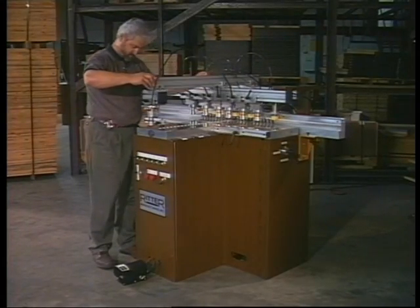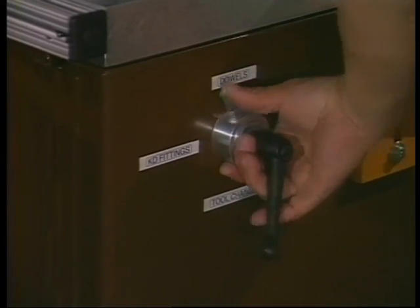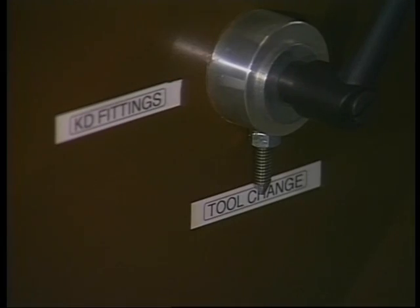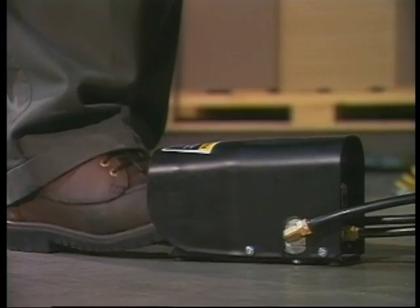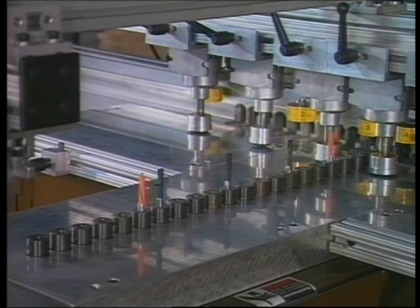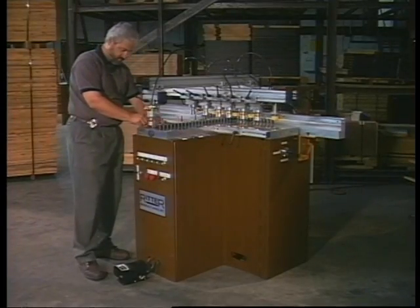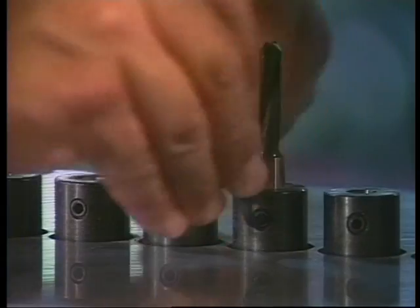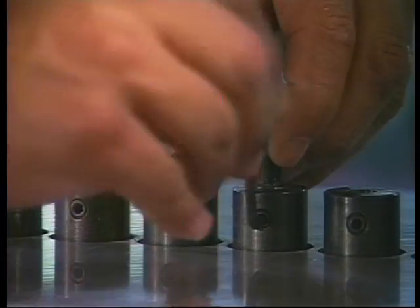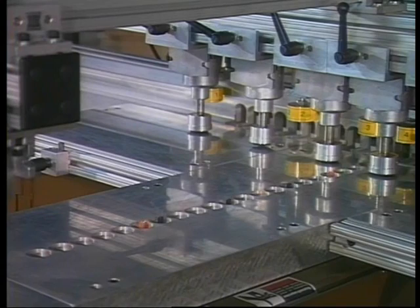Appropriate tooling is rapidly installed to allow planned pattern boring from the right or left side of the drill head. Set the turret depth selector to tool change and depress the foot pedal. Next, engage the lock switch when the drills are fully raised above the table. When change of tooling is completed, release the lock switch and the head returns to its retracted position.